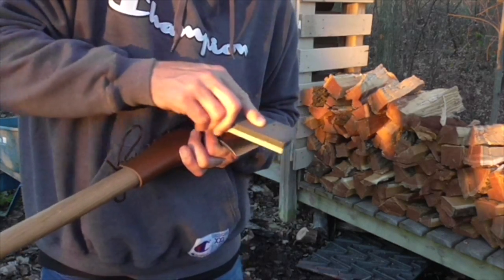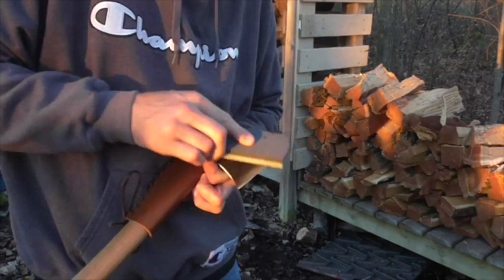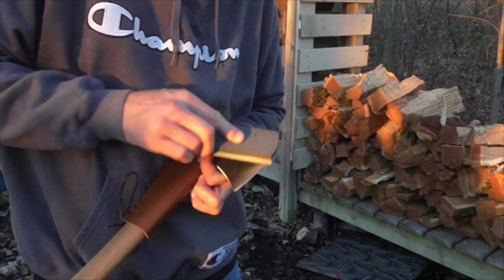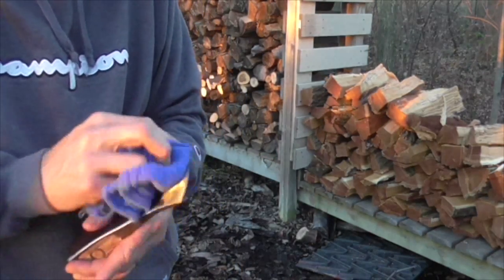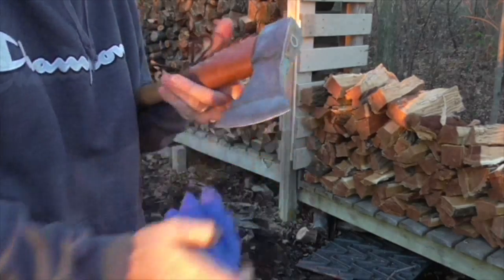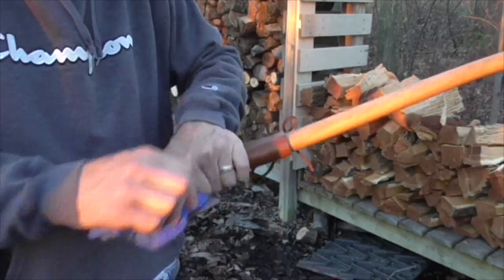You can see it's fine tuning the sharpness here. I have a feeling this is going to come out nice and sharp. Now I've gone on both sides with both the coarse and the fine side of the stone. I'm going to wipe it off and get all that oil off. I've heard that using a leather strop works really well for putting a nice finished edge and a polish on your axe, hatchet, or knives — that's what the old-time barbers used.